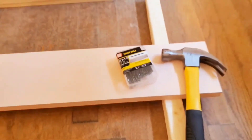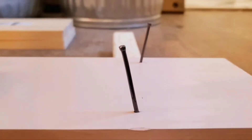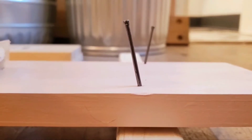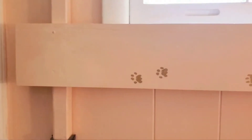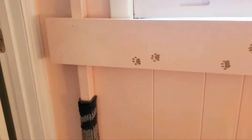If I had a hammer... So I'm getting the nails started so when I put the board up there it's just a matter of tapping it in. This is a trick I learned in my short time as a carpenter — if you angle two nails slightly toward each other, they're going to pull into the board behind it, or in this case it's going to be a two by two. So yeah, okay, so far so good. It's not gonna stay like this, I'm gonna add something on here, we'll see what happens.